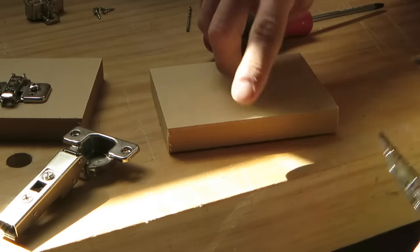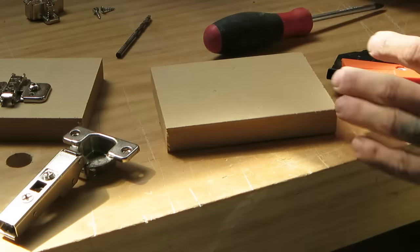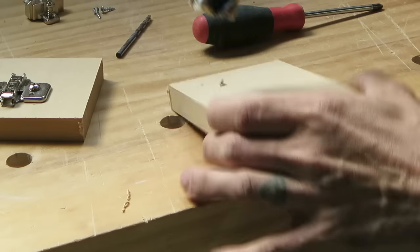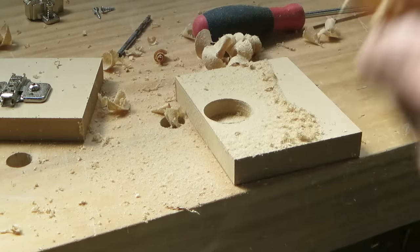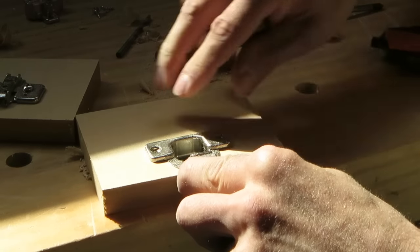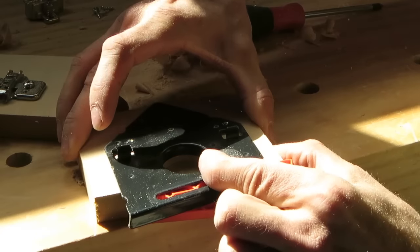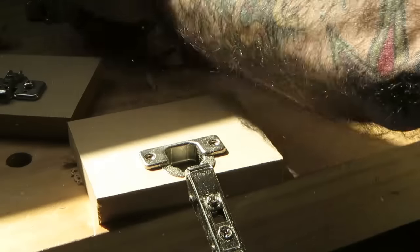These hinges say that you need to come back 20mm from the edge, so that's on my jig — 20mm — that's the center of my 35mm hole. For the sake of speed I'm not going to put this in a drill press; I'll just do it with my drill, which is not entirely the best way to do it. That just needs to go in there. You need to square this up — the jig has a part that fits into the hole, and by sliding the wedge it squares up the two screw hole guides. Put it in there, put it up, and screw in my hinge.